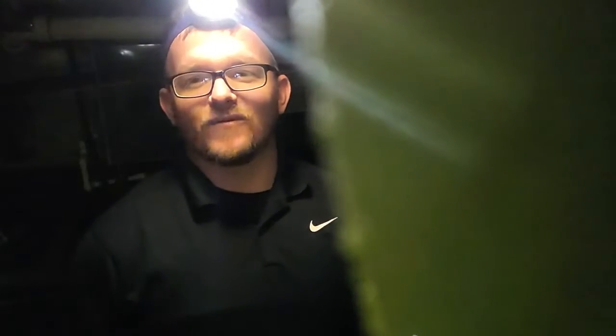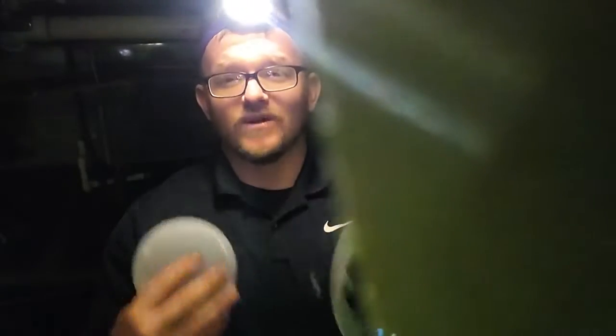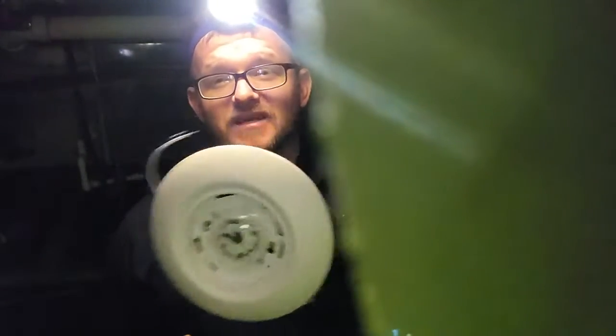We're in the crawl space today getting ready to install a disc LED fixture. One thing to be mindful of when working in crawl spaces is that lighting is now required to be GFCI protected, as well as receptacles. You may not think about it, especially doing retroactive work — it's very intuitive to think about GFCI for receptacles in damp places, but now it's required for lighting also. I do want to note: if you're doing a new install and that circuit goes into an area requiring AFCI protection, you would be required to do both.